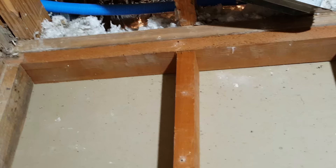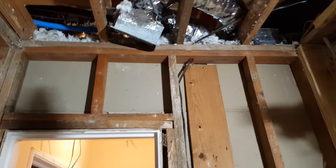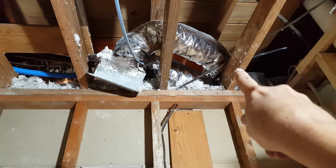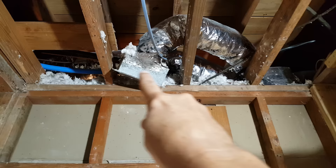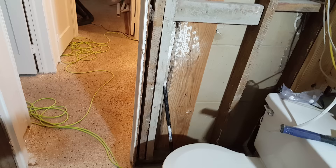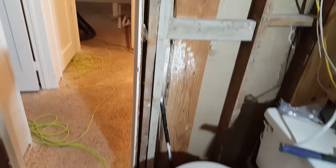You're probably wondering why that extra 2x4 is there. The reason is building safety. When you build a building, theoretically your rafters — which are the ones way up high that run along the roofline — and these joists here should theoretically be straight over every one of the studs so that the point load comes straight down the stud, all the way down to the ground. This is a cement slab below us, but if there was a basement, you should see poles or something right below this point to carry that point load all the way down to the slab.